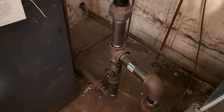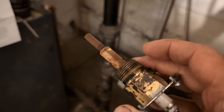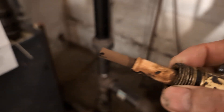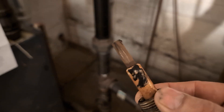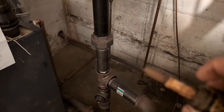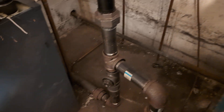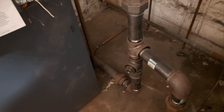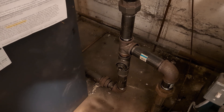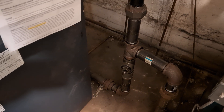Something a bit more subtle and annoying: this is the probe we pulled from that location, and it's got a coating of grease on it. What tends to happen is the resistance temporarily goes above 5,000 ohms, causing nuisance lockout. The system locks out and you get a no-heat condition — not due to an actual low water condition.